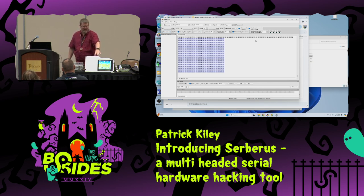But the main method of communication on this device is actually CAN bus, but because they want to be interoperable, they also offer serial. So I've connected up to the serial so we can do additional instrumentation work and exploration of it, but it'll connect up to a transponder, connect up to a radio, ADS-B, so it'll actually see the aircraft around it and just put them up on the display here. But you can see everything shifting as the gyro on this particular device moves.